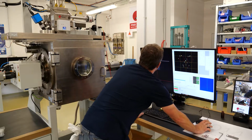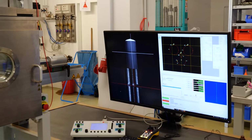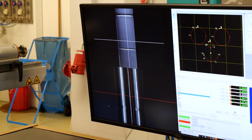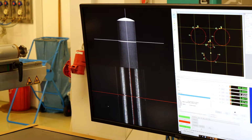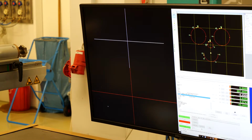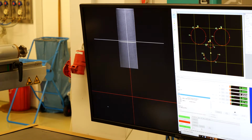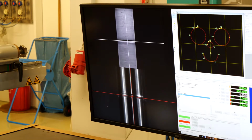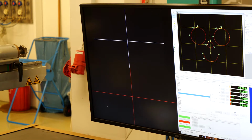There's a beam guide tube where we have not exact parallel beam incidence. In the optical image, you can see the welded picture. So beam current is 2.5 milliamps. Basically this is just going through all these weld seams, which we had previously shown in the open vented chamber.